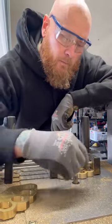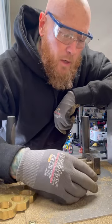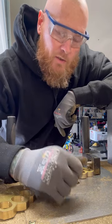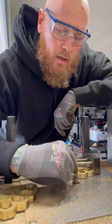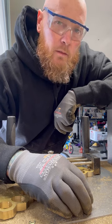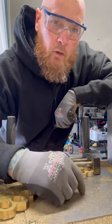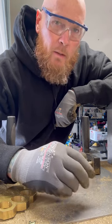And if you heard, when it would buck back up against me, you could probably hear that. That was those catches. And if you were holding it with your hand, applying the pressure against that carbide bit, when it bucks, it'll snatch it out of your hands if you're not holding it tight enough. So any break in concentration, that thing will wreck your knuckles, or it'll pull your finger into this bit. So you don't want to do that. I definitely recommend the jig.